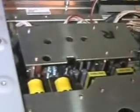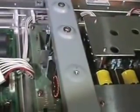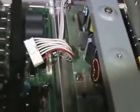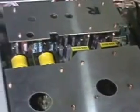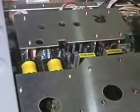Okay, here's another test you can do if you suspect a bad board. I was thinking just by the results that we saw on the screen, the display, you're looking at a bad Z sustain board. And when I unplug the Z sustain board, which I've done here, then I go to power the unit on. I've got no zap sound.